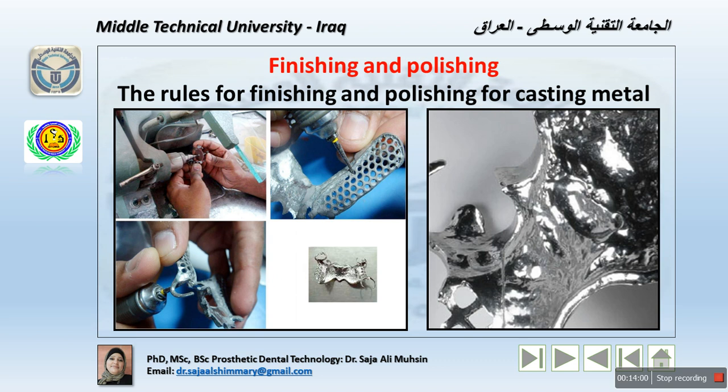The RPI should be well finished and polished, and the tissue surface of the maxillary partial is finished with the wet pumice only, and tripoli. Do not over polish it. Do not use another stone or rubber wheel, to avoid loss of intimate tissue contact there. Only the wet pumice with tripoli and rouge, just gently. And sometimes we prefer only the pickling procedure and the polishing, and do not touch the tissue surface in terms of a perfect framework. The complete framework is then returned to the master cast